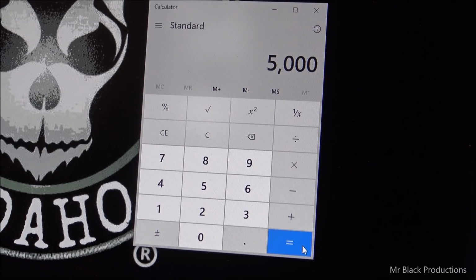So if you pick up a transformer, and we're just going to pull a number out of our ass, we'll say 1,780 volts on the secondary, or otherwise the output side of the transformer, something that you're going to attach to the rectifier. This is pre-rectified voltage, okay? We're going to times that by 1.41, and that's going to give you your post-rectified voltage. A lot of guys really struggle with this.